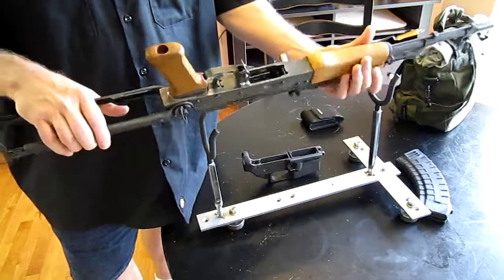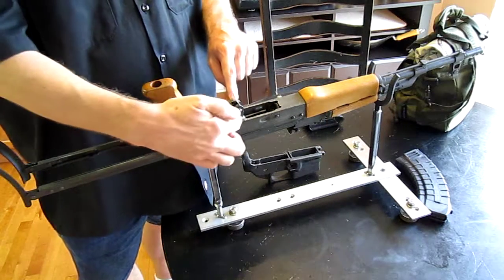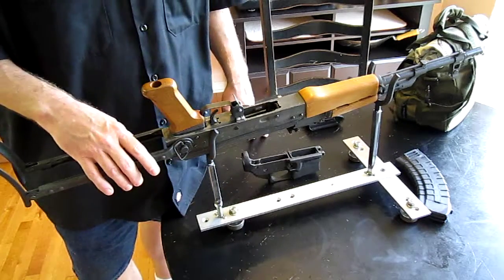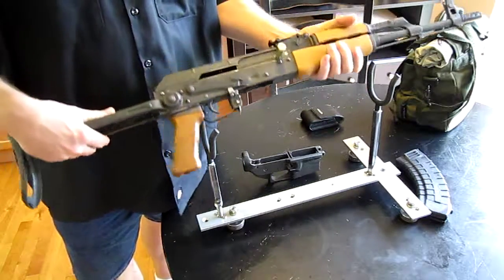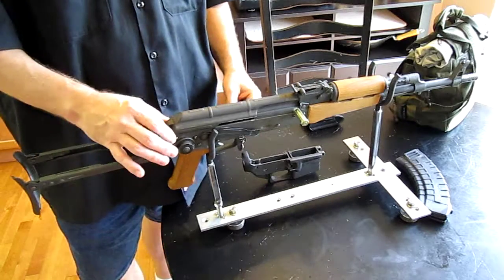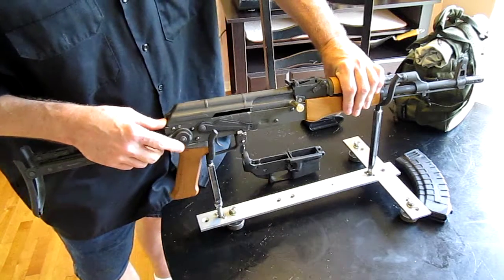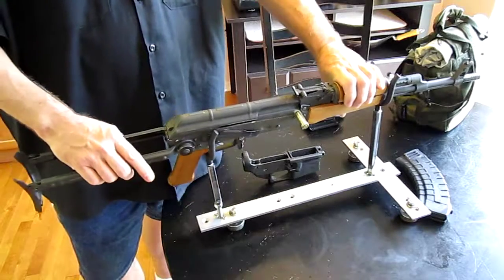There are still a few things I've got to re-parkerize because I did change out the two spacers down here. I did not rivet these — I bolted them just because I didn't have the appropriate rivet tool, so I made my own. Pretty much I'm going to take it apart eventually and re-parkerize the back half where everything got ground and cut, because I had assumed everything was going to fit proper and then parkerized it. I should have completely assembled everything after it was sandblasted to verify.